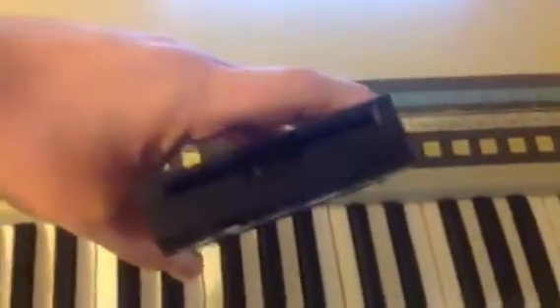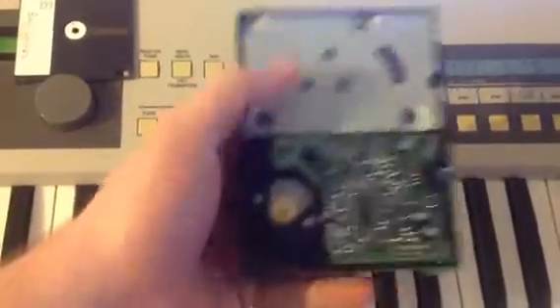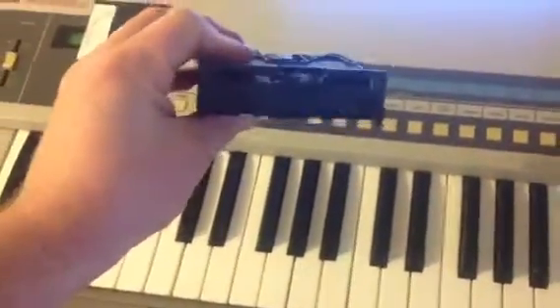They're 64k each side and they're an absolute nightmare to repair. I've spent a few weeks now trying to repair some Roland Quick Disc drives. Basically what happens is the belt from this part onto the gears just perishes — not because of use, just because of age. Simple as that. So I spent a good £100 trying to get all the belts for all the drives. Still no luck, to be honest.